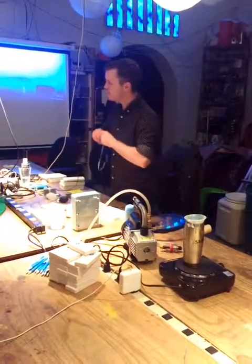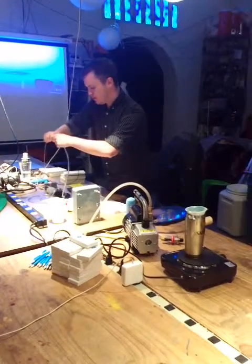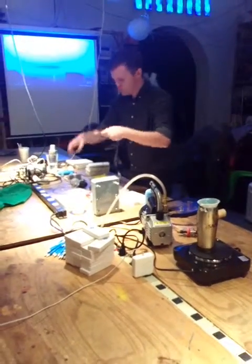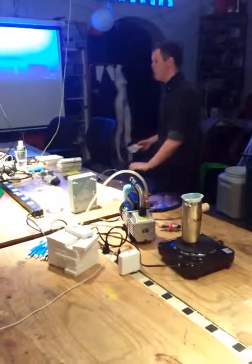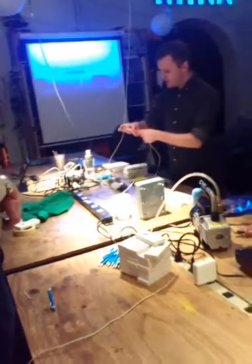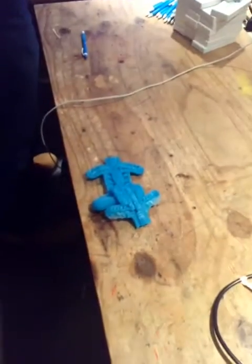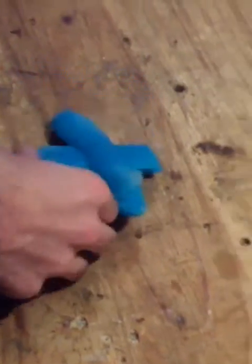How do you make different colors? I think it's really just pigment and silicone oil. There's a product called Silc Pig that is different pots of essentially silicone paint, and you can mix them with your silicones to tint them. I like tinting them because this one has an odd shape to it and is a little bit harder to parse, and I find that the even blue tint of the one that I use for demonstration purposes helps.